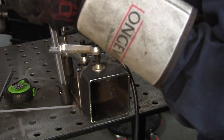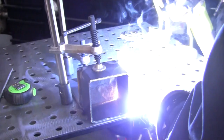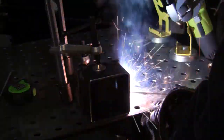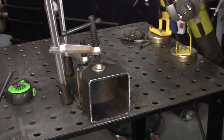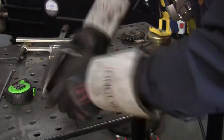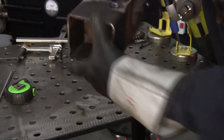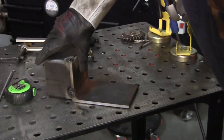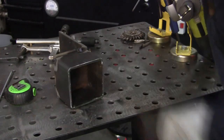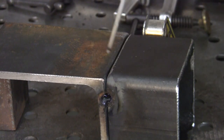Keep it like a short arc on it — I'm not going to run downhand. It's tacked up, you got it clamped. It's not going to be pretty anyway, but it's going to be covered with cement. Pop the clamps off and we've got it — that way when I go to weld it, it's nice and flush right here. Now when I just run the bead, you've got that structural integrity. Let me show you how it runs on a regular full bead. This is our beveled side, nice and flush. There's going to be a gap but I still want to get that root pass.